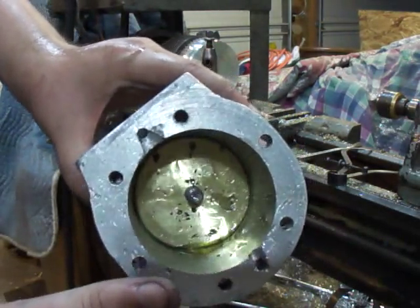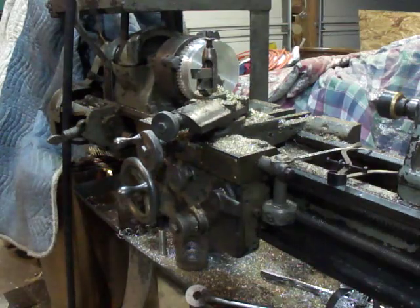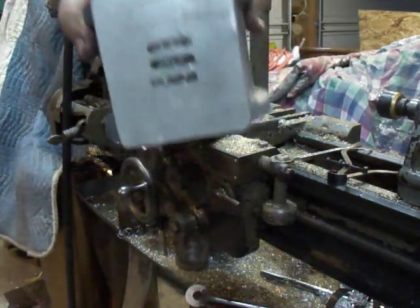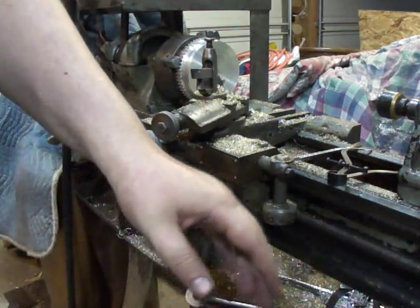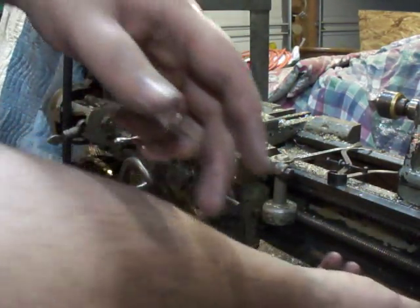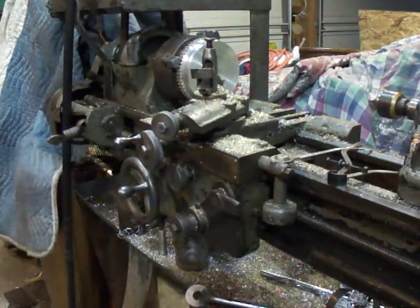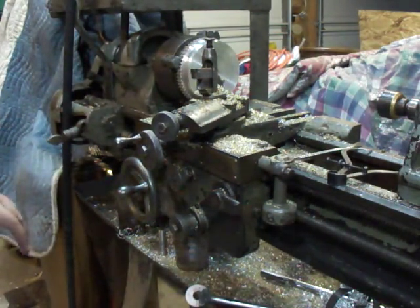It was really bad on this side, but it keeps going through freely. I just don't want to lose oil all over myself. This is why I hate cast brass — hopefully you can see this. Those are all little blisters from being burnt; they go all the way up my arm. Those little red spots are all blisters from being burnt from the shavings coming off the brass. It's a lot harder so it comes off a lot hotter. This is why I hate machining cast brass.